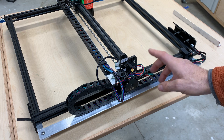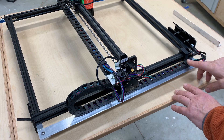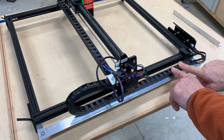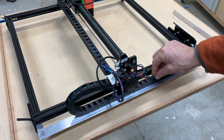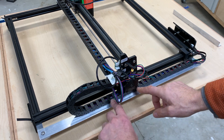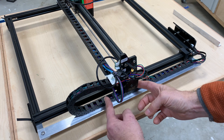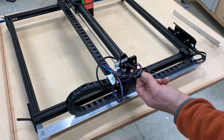You have four wires going to the first stepper motor, each a different color, so I cut them at slightly different lengths for each connector so I wouldn't have four bulky connectors all in one place. I did the same thing on the other side — spread the four connections out over a distance. The toughest wire is probably this black wire, which feeds the laser as well as the stop bump switch down here.